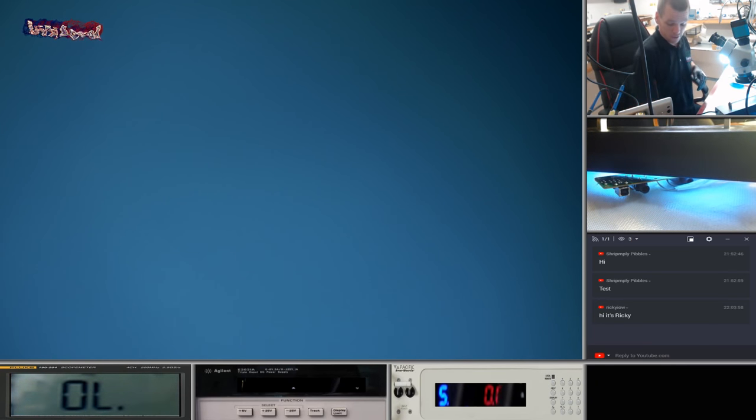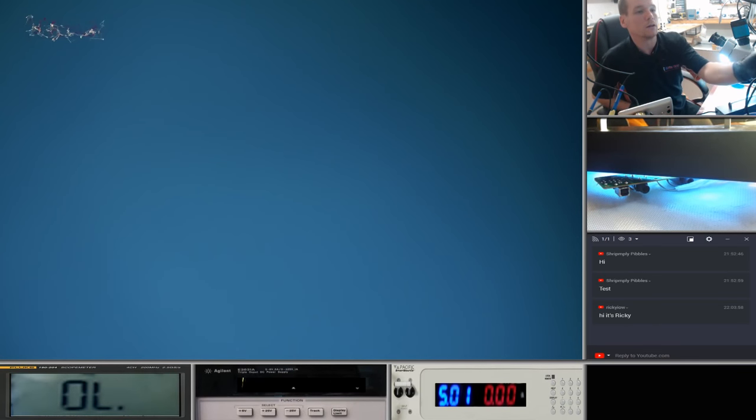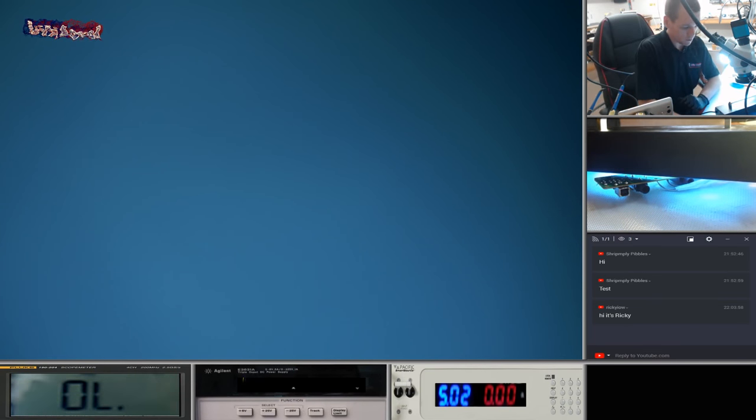I only had a quick look at this Yamaha earlier and I thought, oh, it's perfect for the start of a live stream. I thought we can quickly scrape away at the tracks there. If I'd actually thought about it a bit clearer, I could have just run both jumpers, not actually cut into it. And probably a 5 minute job with the epoxy resin as well. But it should be a good fix, you know, once those tracks have been retracked, it should be as good as it was before.